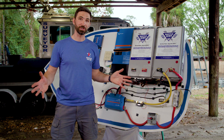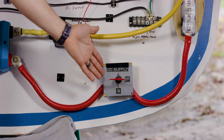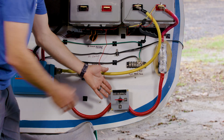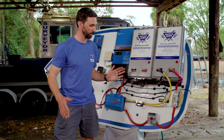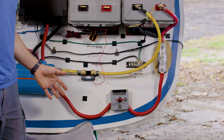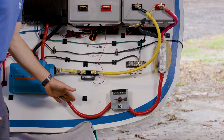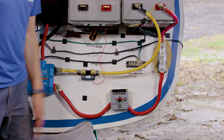It's also very important to have a main battery disconnect switch. This would be just downstream of your class T fuse, and the purpose is to shut off the entire battery bank if there ever was a problem. It has to be rated for the maximum amperage of the circuit — it has to be a very large, powerful switch — and it goes in the main conductor, probably near the battery bank or close to the fuse.